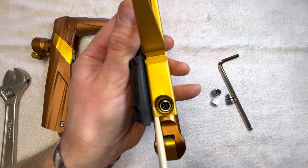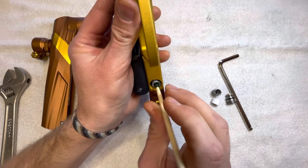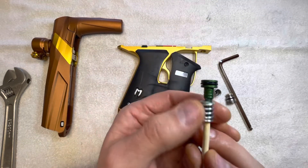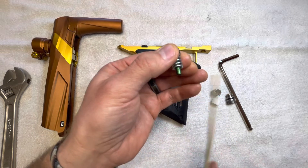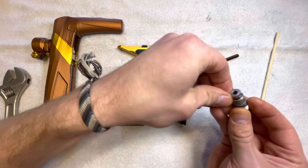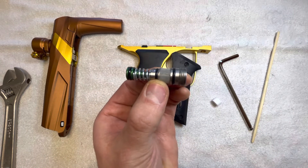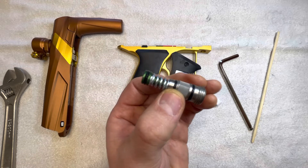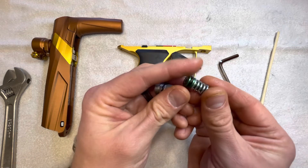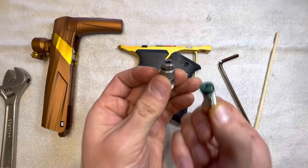The way that I generally do it is with this kind of modified little chopstick I have — it gently fits in there and pulls it out so we're not at any risk of scratching the aluminum. When it's all together, this is going to look like this — fairly simple, pretty normal kind of reg construction. There's nothing crazy about this. Another thing you're going to want to check is this O-ring here and then this sealing O-ring on the inside.